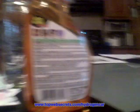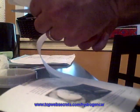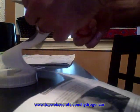Here's the finished one that I just did. Now I made a copy of the template and I'm going to cut it out with scissors because it matches the size of the lid exactly. Then we will tape the template to the top and mark the holes. It takes a little bit of extra work, but once you have the template, you can reuse it to make other lids if you need to make more than one electrolyzer. Remember to cut it out and poke the holes through with the tip of the pen.